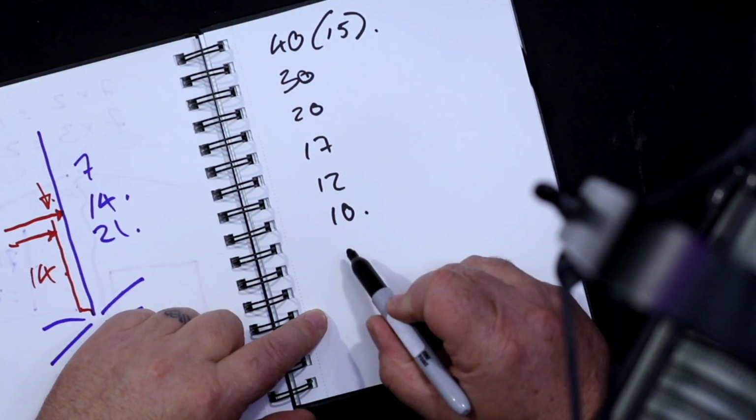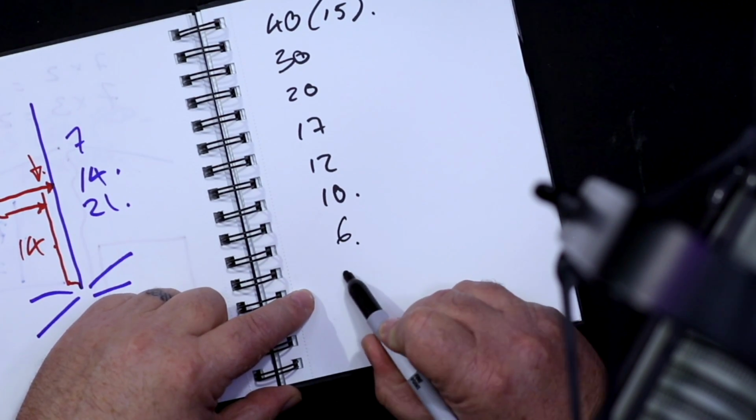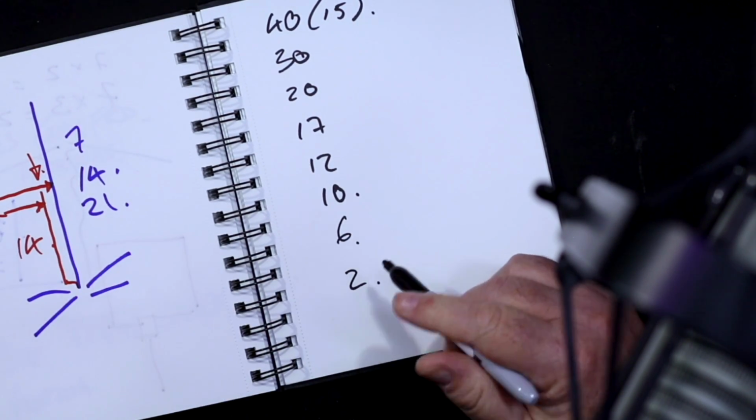And then with the magic of RF and because of the harmonics I discussed with you, on that configuration, it just so happens you get a good match on 6. And I've seen people on YouTube actually opening the repeaters 50 miles away on 2 meters. Although as you know, on VHF, you really need a bit of height. You get it on your rooftop or something, and a Diamond X510 or something was going to be infinitely better than basically a ground-mounted 2-meter antenna. So that's what DX Commander is.